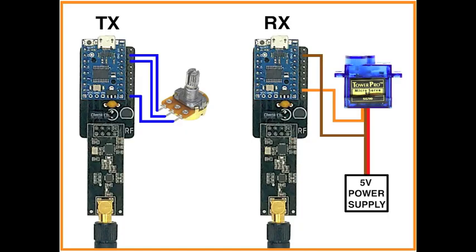The HackerBox DigiPro NRF boards also break out a row of pins from the DigiSpark Pro. These pins have some of the unused I/O lines from the microcontroller, and also a power and a ground, so prototyping or other items can be connected onto the microcontroller.